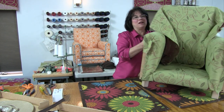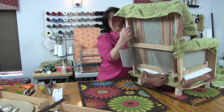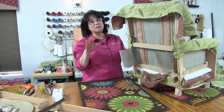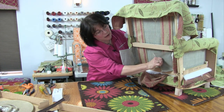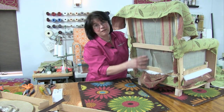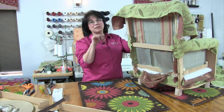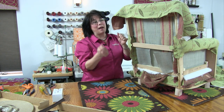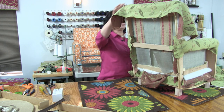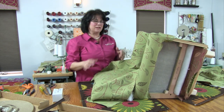So if you remember, we had the sagless with the jute webbing and got a couple staples in the top and a couple in the bottom. The next thing we need to do is make our cuts in order to get the rest of the fabric into the areas it needs to be. We've created an area using jute webbing strips and making cuts in the sagless so the inside back fabric can come through and be attached right on top of the inside arm.